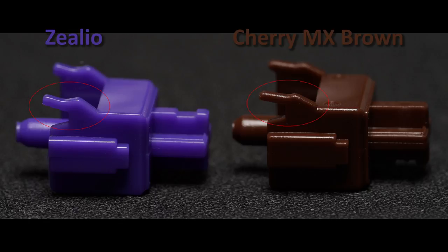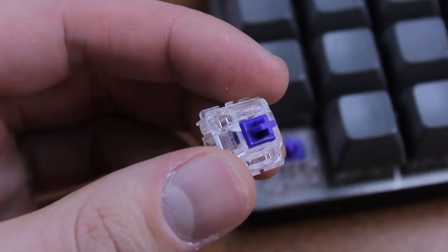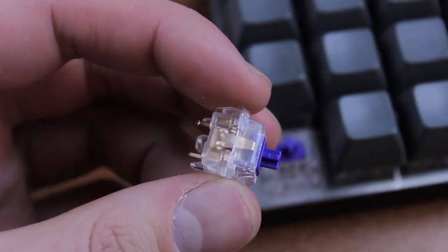Similarly, the switch housing has been made using a custom mold and a very high-grade translucent plastic. It's all nylon and no fiberglass, which helps prevent friction with the slider and makes the key action smoother. But in order to attain this, they had to leave out the heat stabilizers that are commonly added to the plastics.